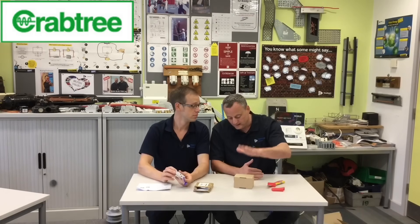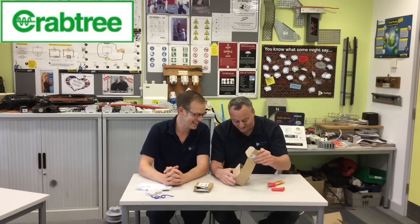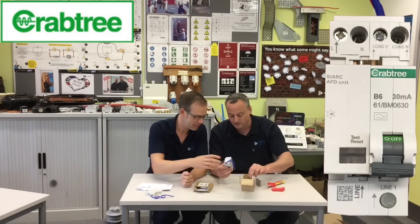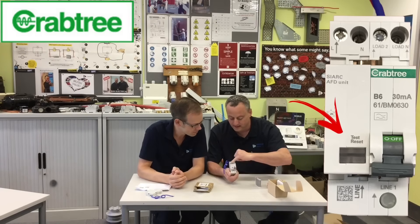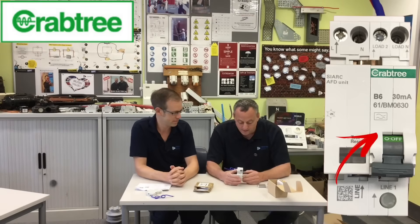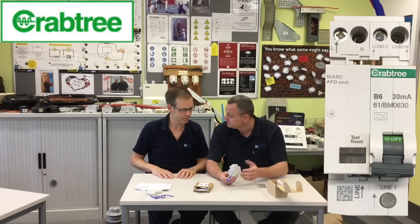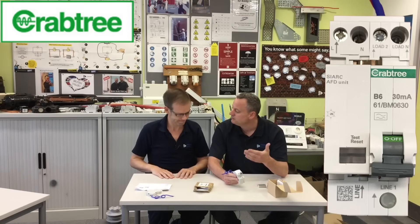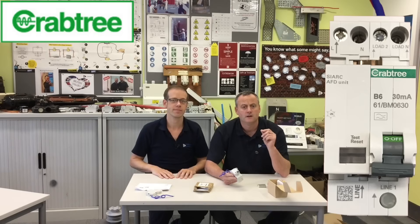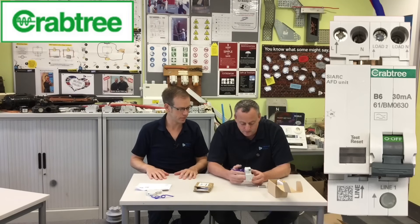Now we might have to undo that thinking with the AFDD. We might need to modify what we're doing. So let's have an excited look inside this box. He's actually got us a completed unit, so we actually have the unit complete. This side here is our fault detection device and it's already been strapped across — we'll show that in a video. We're going to actually unassemble these and fit them and all the rest of it. He's also given me another 6 amp RCBO. The reason we'd like a 6 amp one is the learning jobs are going to do lighting circuits. We'd like to think that we only got one at the moment — obviously because they're reasonably expensive. We expect that to come down over time. But when you see the benefits of using them, the cost is irrelevant. You've got a quarter of a million pound house and everybody you love in it and your TV, which you also love, and that burns to the ground — or you can start fitting these.